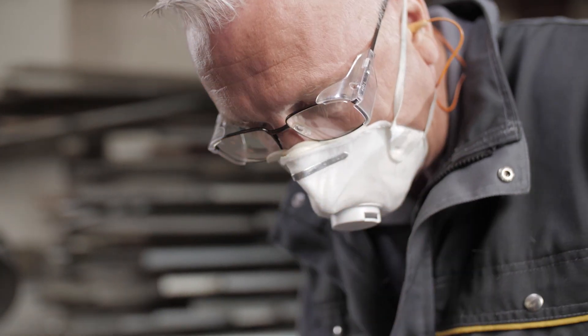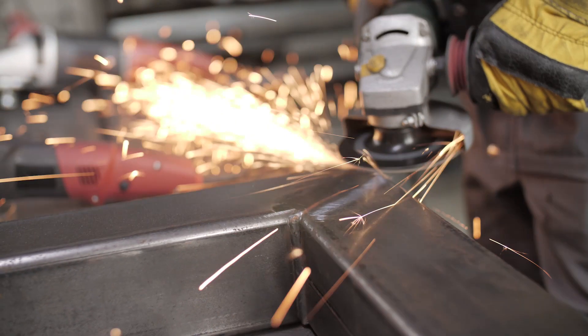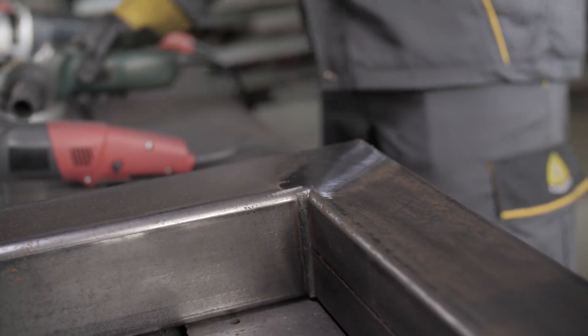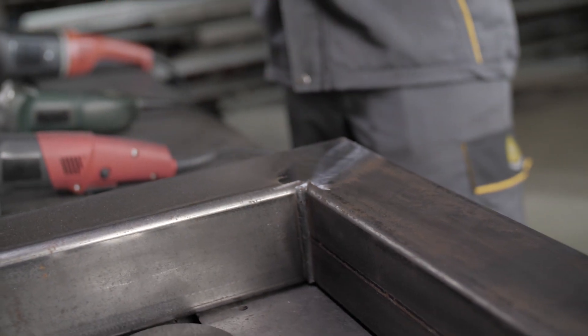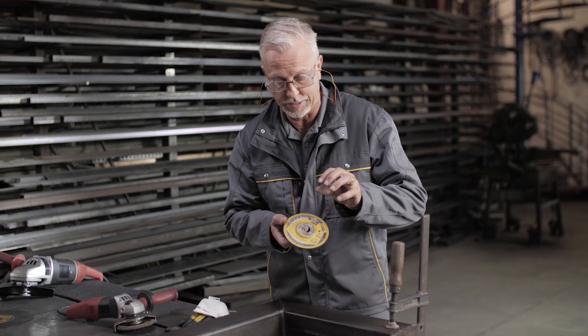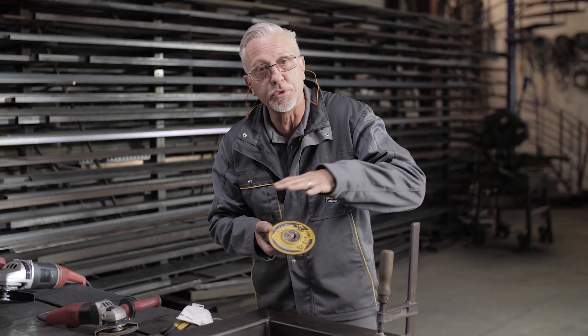Just working in one direction gives a much more even finish to the workpiece. The grinding disc re-sharpens, but throughout its lifetime it's reducing in diameter, and as it gets smaller, the surface speed also reduces — allowing less and less material to be removed throughout its lifetime.